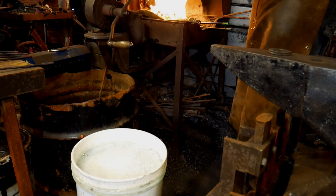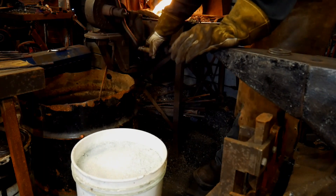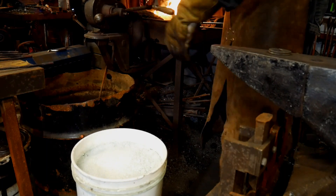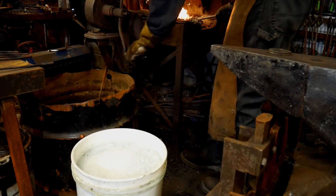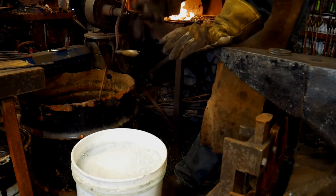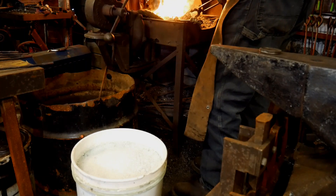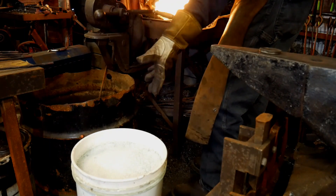Okay, so I've got this piece about up to temperature. Now in one of my super quench videos when I did a bunch of testing — which is not scientific testing and I don't care to test this stuff out scientifically — one of the things that I got harassed about quite a bit was that I did not heat up the mild steel up to a critical temperature, or what would be considered a critical temperature of non-magnetic. So I'm going to do that with this block and we'll see if we have any sort of different results. Then we are going to quench it in the super quench.